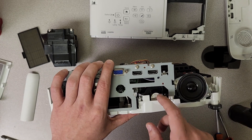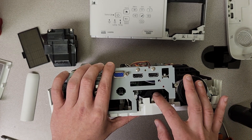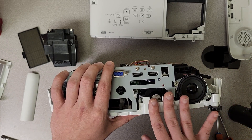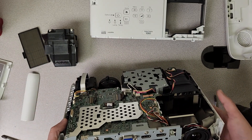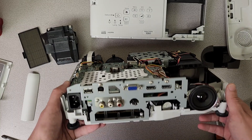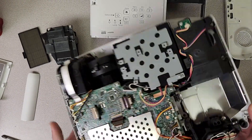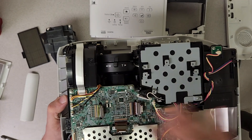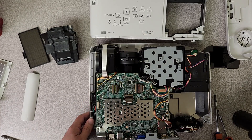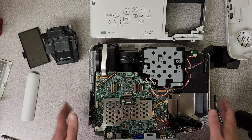If you notice something about it — it's tiny. It's actually smaller than this speaker right here. These have problems; they can fail and cause a lot of issues in your system. This is the most common cause of problems on these units that I've seen. The best thing to do is just get them blown out. Whenever you've got it opened up like this, it's easy to see from the back — you can see the fan blades. If you blow right here, it'll spit the air out through this open compartment and you're not getting anything in front of the lens. That's what you want to avoid — you don't want dust to get in that area, as it can be a pain. When you have it opened up like this, it's easier to clean, but if you can't open it, it can be quite a pain.